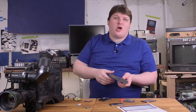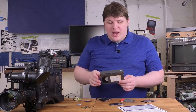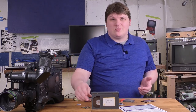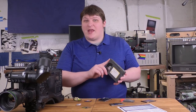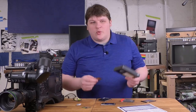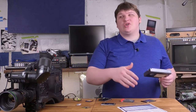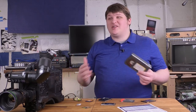At this time, pro video was pretty much all still being recorded on videotape, usually Betacam tape or DV tape. Betacam SP had been around for decades and was more than good enough for most applications. If you really needed something better, there was Digital Betacam, which stored a moderately compressed video stream at 90 megabits per second — that's your high watermark. There was a low-cost variant called Betacam SX that did 18 megabits, which several cards could conceivably hit, but with not much margin of error.